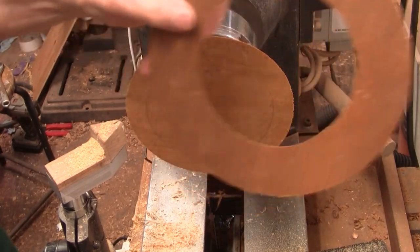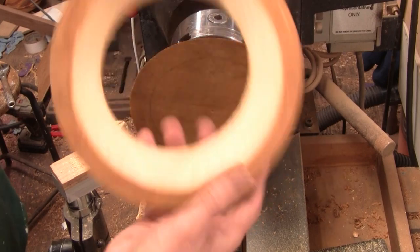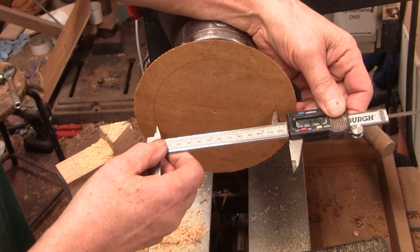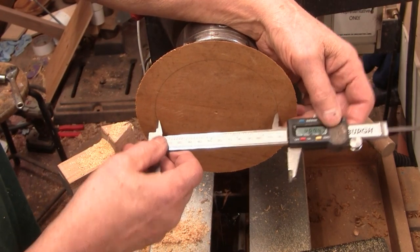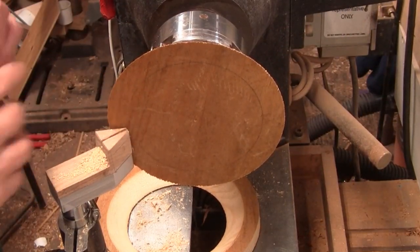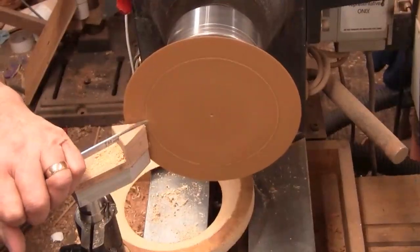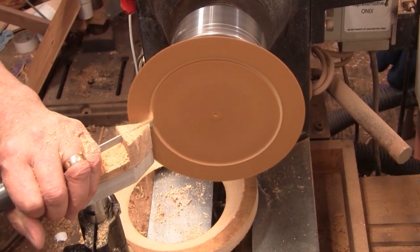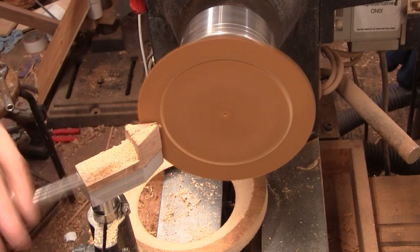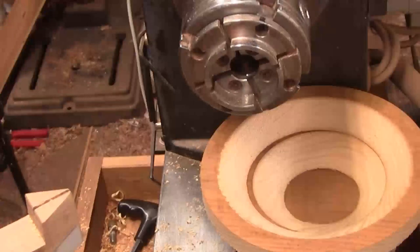I know this was just about building the tool, but I like to talk about this. If you measure that diameter, that's what's going to glue against here — that surface glues against there. I just reached down and took a guess where it would be, put a pencil line on it, and that's right on. What I want to do is cut that side of the line leaving half of the line, and then we will be perfect. I decided to go with 55 degrees on this; I think 60 would be too close to the glued-on tenon. And that is through.